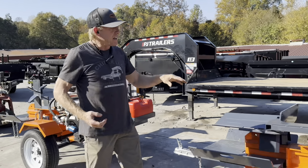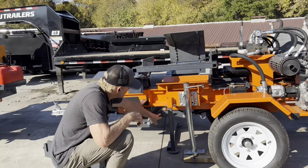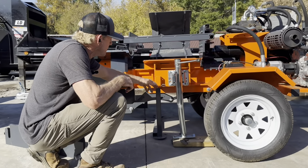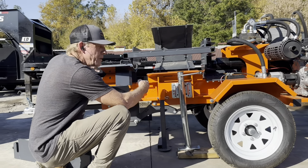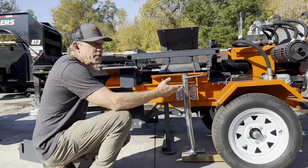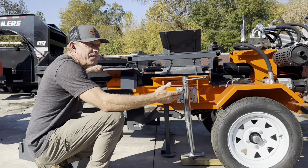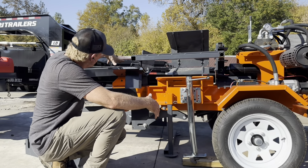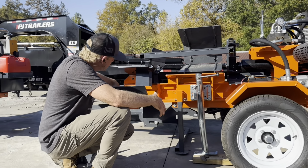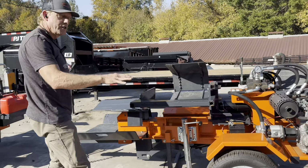So this design is the same kind of setup that Easton Made has set up, which is you have this L-shaped drop leg underneath here. Well, the thing about that is if you push, when we did those 34 inch wide oak rounds, according to Google, those rounds in a log calculator, the round should weigh 586 pounds. Well, if you take 586 pounds, push it out here, plus the weight of the box wedge, plus all this other weight, just barely offsetting that, you're close to being tippy.